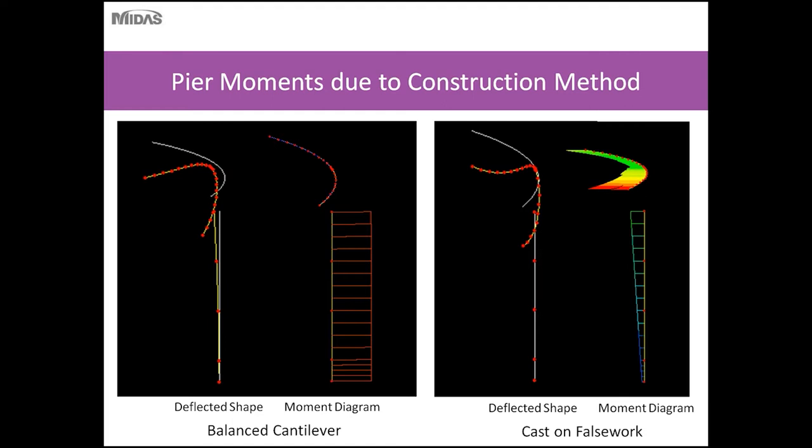And in addition to that, as a designer, you would also be very aware that the moments and the loads transferred to your substructure would be opposite of what you would expect if you erected a bridge on false work. Shown on the left is the bridge erected using the balanced cantilever method. As you make a cantilever unit, the picture on the left shows you the deformed shape,